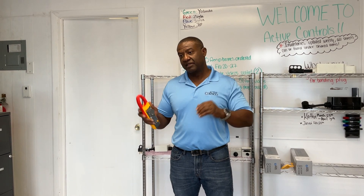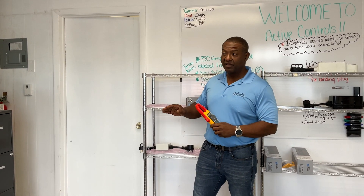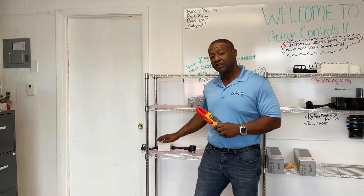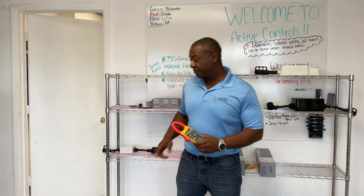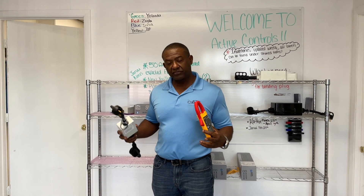A lot of people put a clamp-on meter on and say, 'I don't see any change.' Well, Inrush — as I mentioned — is a function of two components: peak and time. This meter captures that. With that, you can see that the Inrush current on one of my tests went from a 50 amp locked rotor, normally on that compressor, down to 29 amps, which allowed it to start on that 2,000 watt generator. That reduction shows that this product is good for its design purpose, which is to help start on a generator.